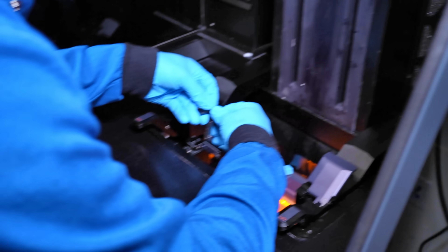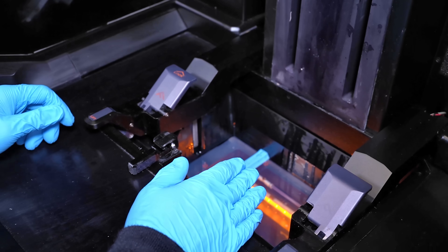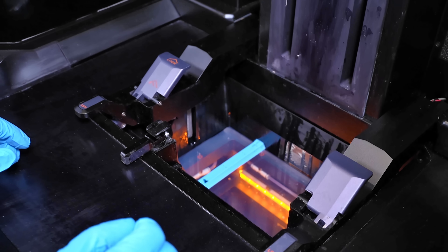The wiper slides right in. The wiper will pass across the film during the printing cycle to help to maintain the resin's particulate from sedimenting out and obscuring the UV light. At this point, we need to add the Rogers material.